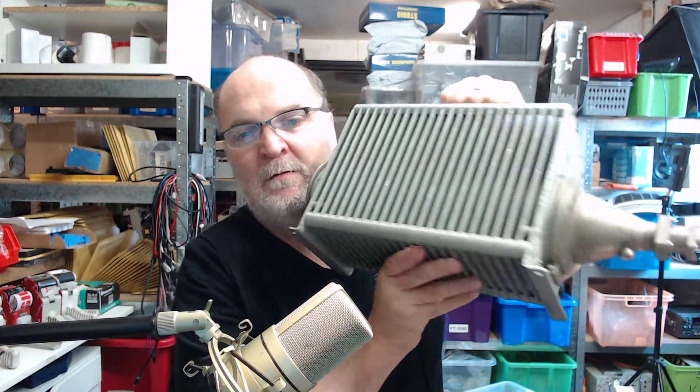I find it quite staggering how much money is being spent these days on amateur radio transceivers - three, four, five thousand pounds, no problem. Amplifiers, same amount. Antennas, you can buy all sorts of things for many hundreds or even thousands of pounds. What people don't invest in is a simple tool - a resistor. I'm talking about these ones: dummy loads, terminal resistors, 50 ohm impedance. You should ideally connect them to your amplifier when you tune it.